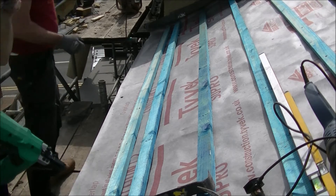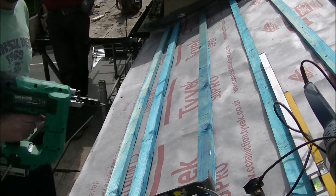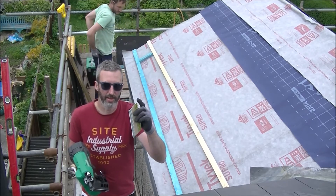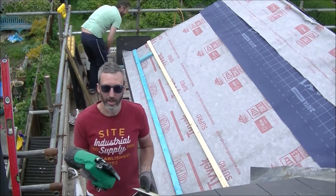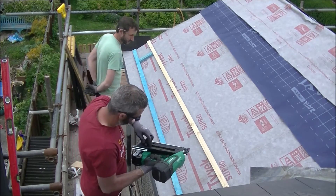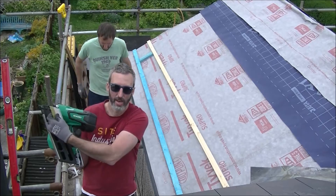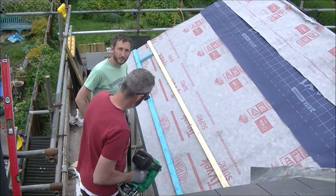Give it a go, Pouse — put your glasses on. Push it down, one-handed. There we go. No problem at all for a little spratt like me. Nice machine. The nails we're using are collated clip head — they come with a bit of paper tape and a little bit of glue on the bottom to help them seal in. They're actually Hikoki nails. We slide them into the cartridge and pull back. One complaint I've noticed: although you've got a huge magazine, the nail strips come in sizes where you can't fit two in, and one only just over half-fills it, which is a little bit annoying — you'd have to break or cut them to fit.